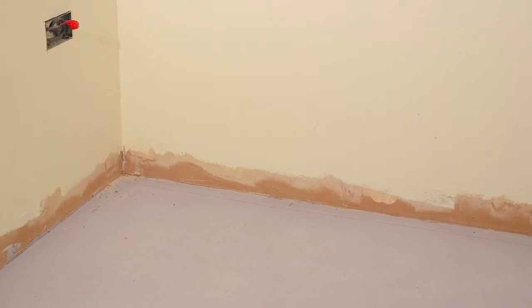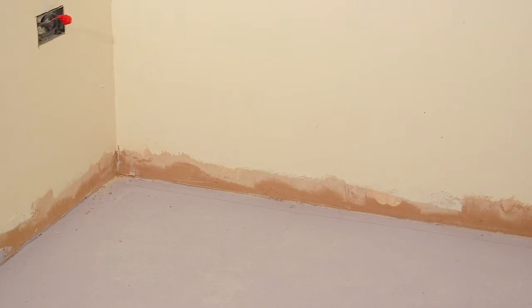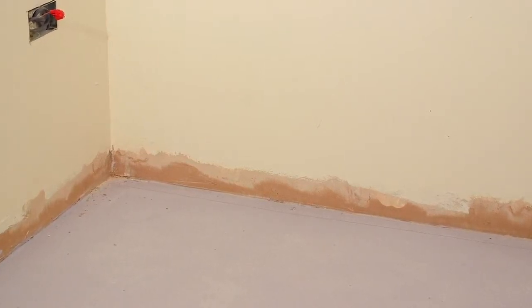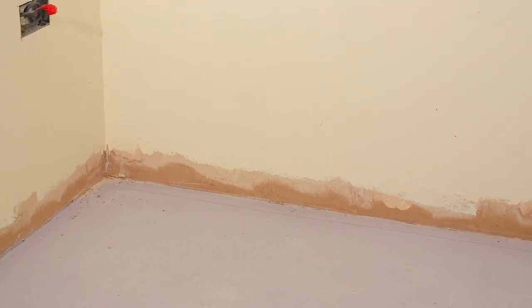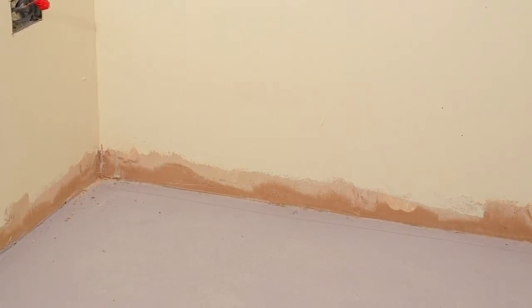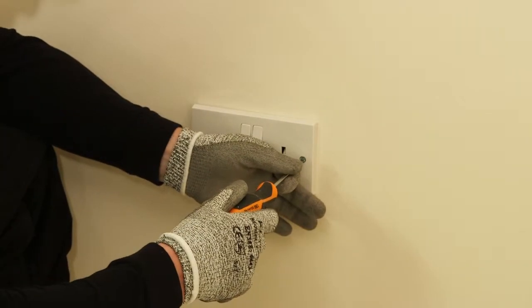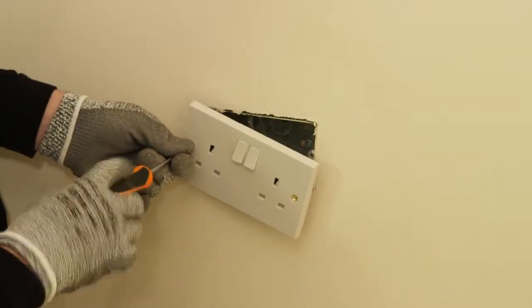Very often the plaster will not continue down to the floor surface, and there will be gaps between the floorboards and masonry wall. When this occurs, it is important to fill the gap at the floor level with Thistle undercoat plaster. This will minimize any air leakage and improve optimum sound insulation when the new lining system is installed. Ensure all services have been isolated by a competent tradesperson to enable works to start.